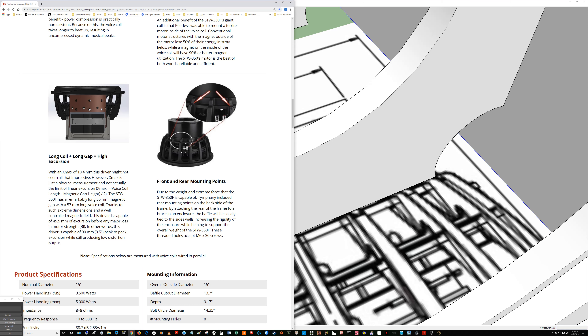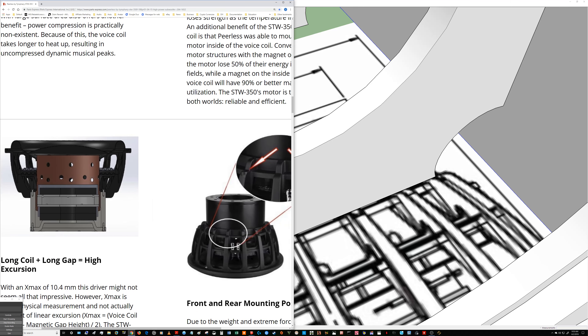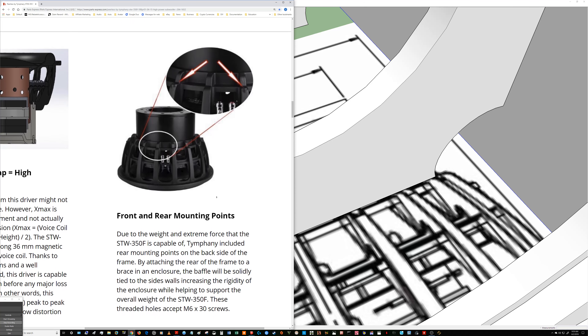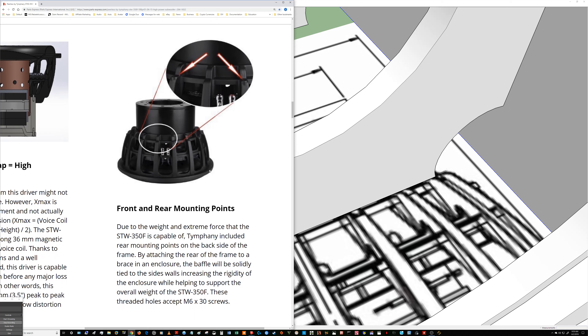This inner bracing is all about the rear mount that this subwoofer comes equipped with. We can hop over to Parts Express to get another look at that — you have front and rear mounting points, indicated by arrows showing M6 screw holes for the rear. The front holes are actually M5 screws, which is not indicated there — I had to learn that the hard way. They also want a depth of 30, so keep that in mind.